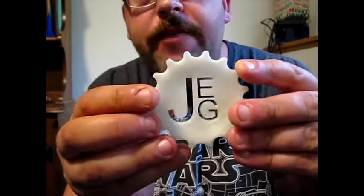Let's go back out to the corner and I'll talk about how this actually printed. Alright guys, we're back here in the corner. Here's the piece we were looking at — give you a good look at that. This was printed at 205°C on a 65 degree bed. Something I want to point out right away: make sure if you're going to print glow-in-the-dark, you've got yourself a hardened nozzle.